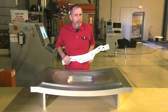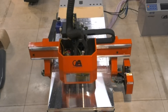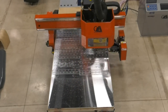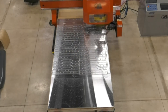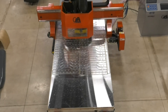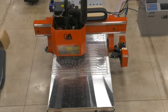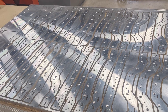But what about all the machining to make these things? This is done by nesting the parts on a large sheet of aluminum and machining them all at once using the Cut Layer Additive machine. Yes, there is a lot of machining, but it's all automatic. And remember, this is all high-speed machining, much faster than normal metal cutting. On regular mills it would take forever. With the specialized Cut Layer machine designed for just this, it becomes really practical. Parts are machined all at once and don't need to be handled individually. Little or no operator interface. What looks like a really difficult machining process is actually rather easy — you could even call it simple.